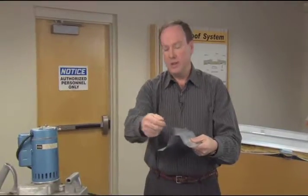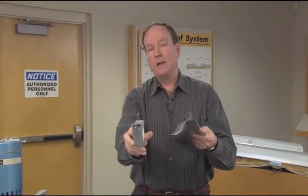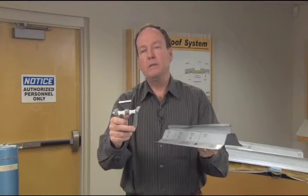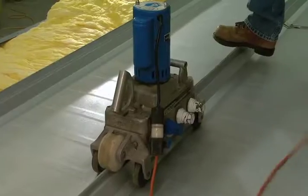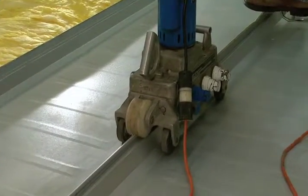The panel starts out in this configuration. You lap the attachment clip to the one side of the panel. As it's joined up, it gets rolled up — these tabs get rolled up inside there, and that's what holds the roof down to the structural system. That's the same seam that's on top of a barrel or a drum, and it's the tightest seam in the business.